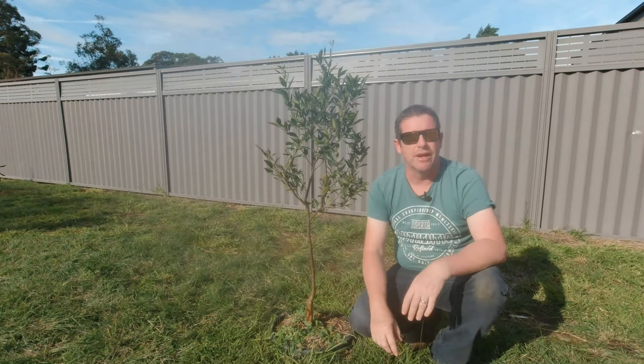One thing to note, when you are allowing for services or roots or any obstruction that runs through past your edging, as long as you're not going to see the hole that's been cut in it, make it a little bit larger. That way you've got some wiggle room when you go to put it in. There's nothing worse than trying to get it all fitted in, particularly on these curves where it's quite tight and you're pulling it from side to side, and then you've got to pull it back out, and all the sand, in our case fairly loose dirt, falls in, and then you need to scoop it all back out, and it's a real headache. So I'll probably mark from here to here, keep on working.